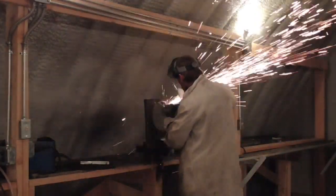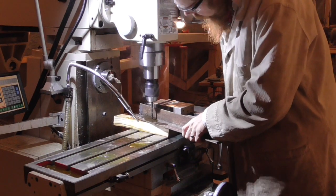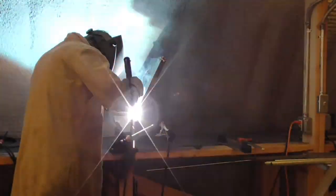Anyway, after cutting the large circular hole in the one-inch plate, I drilled a few small screw holes in some scraps of heavy-gauge angle iron, and welded them to the bottom end of the plate to facilitate attachment of a wooden base.